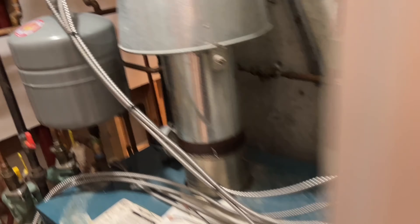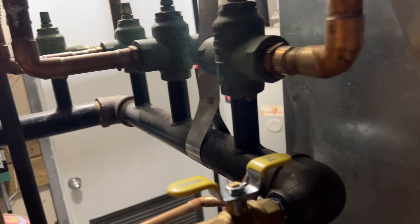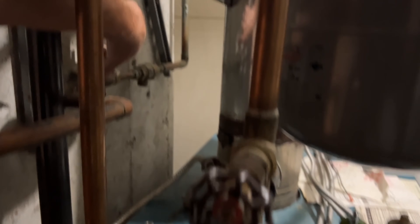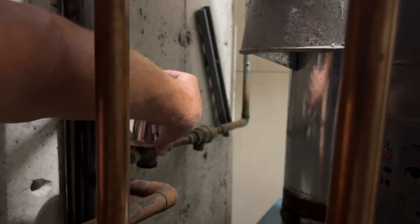Let me show you the piping we added to the boiler. I took off the cap — that was the end of the supply manifold. Threw in a valve, here's my mixing valve, circulator. I've got the Webstone isolation flanges — one with purge, one without. This is my supply, this is my return. I have a T here so I go through the mixed water there and back around. This system runs at 22 PSI. Let's go back upstairs and see how we're doing.